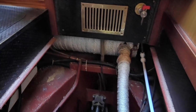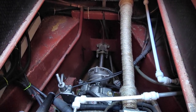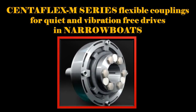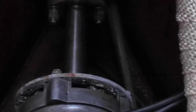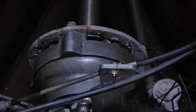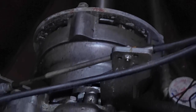Down there we've also got something - you can see it there - that is a Centraflex. The Centraflex stops vibration and noise, and removes any noise coming from the shaft into the boat. Also, if the propeller or anything hits something, all that clunking doesn't go through into the gearbox and damage things - it suppresses it. I would have one of those on any boat.